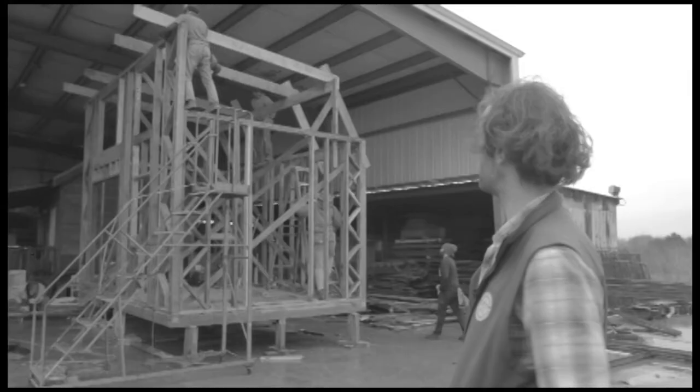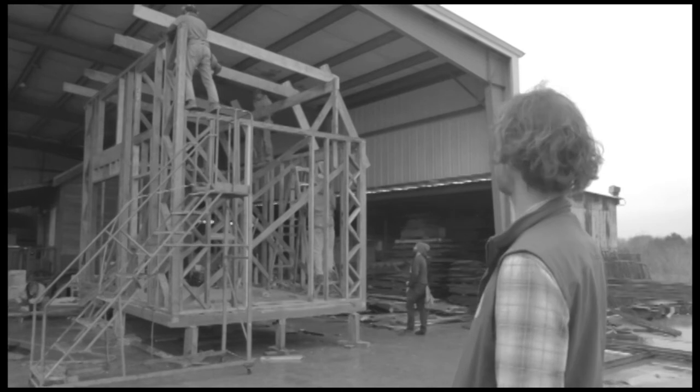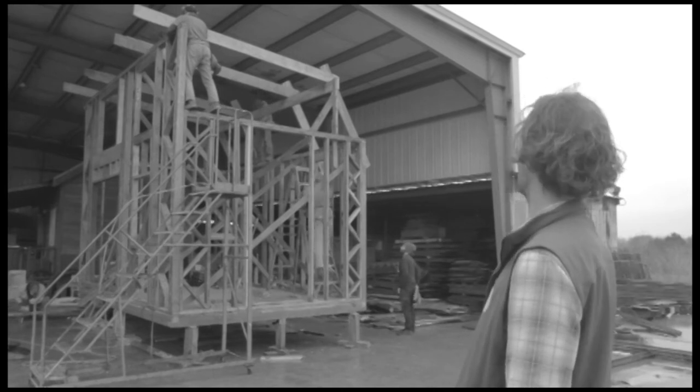Gang nail them together to create one long piece of wood. The next step is adding your rafters — the pieces that come down and actually form the shape of the roof. They get attached to the top plate. You space out a few along the length of the ridge beam, and you can use those to sight down your ridge beam and make sure it's running perfectly straight.